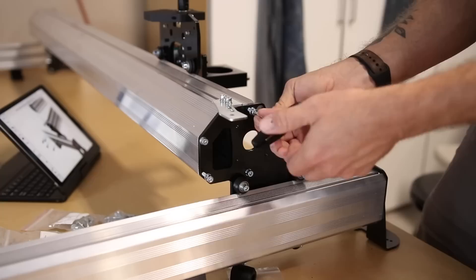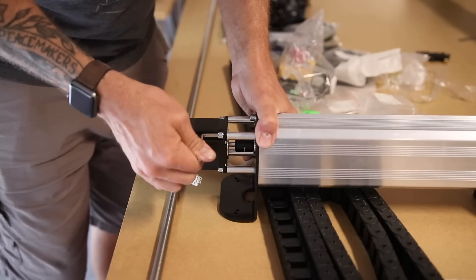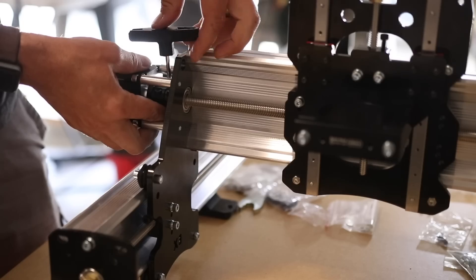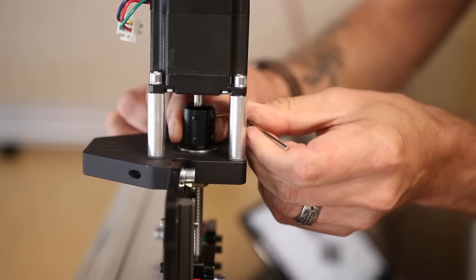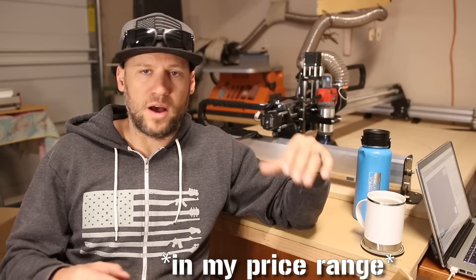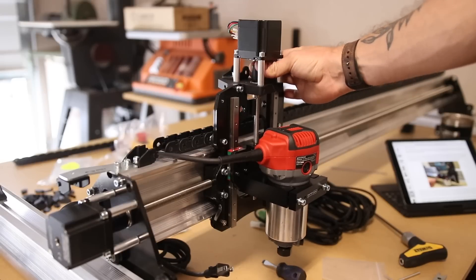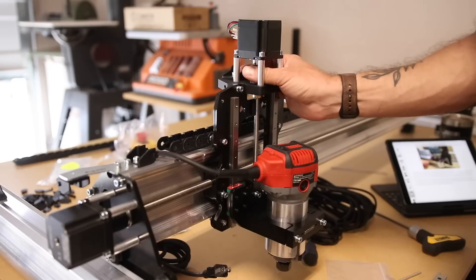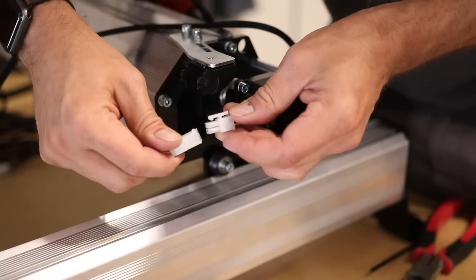That's not to say the Millwright Mega V rack and pinion system wouldn't be good enough for guitar building, because it absolutely is — I know lots of guitar builders using that specific CNC, and it's actually one of the reasons it was on my list. But it just didn't seem to me that the rack and pinion system was really worth the extra money at this point. It's also worth mentioning that the other machines from Millwright and Onefinity only have a 30 by 30 work area, and for even less money, I'm actually getting a much larger machine — and it's still plenty stiff, rigid, and strong.